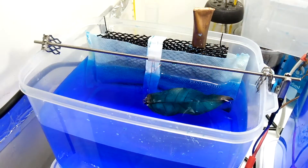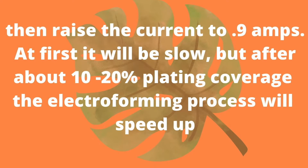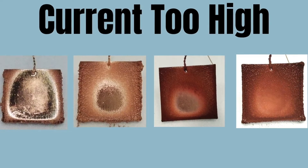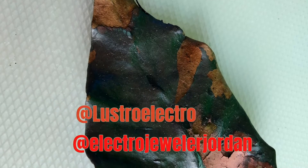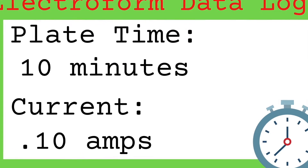We are starting off with a low current and as you see the copper plating spread, you are going to increase the current slowly until it is almost completely covering the leaf, then raise the current to 0.9 amps. At first it will be slow, but after about 10 to 20% coverage the electroforming process will speed up. If you start out at a current setting that's too high you will see bubbles at the hang wire and a dark brown powdery deposit — this will never plate properly, so lower your current. If this happens you may need to take the piece out, brush away the powder, and inspect the paint before proceeding. If you start out slightly too high and your paint is not perfect, plating may stall and build up existing copper without spreading further.